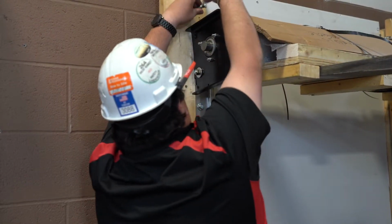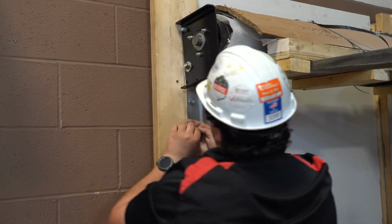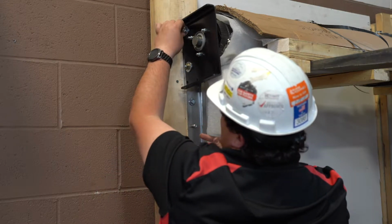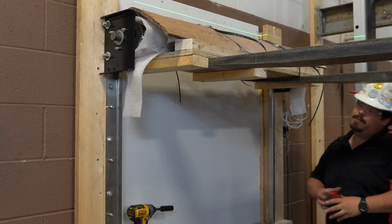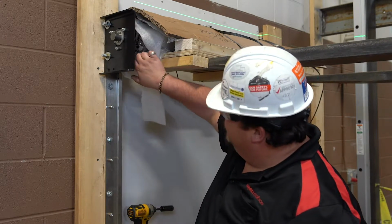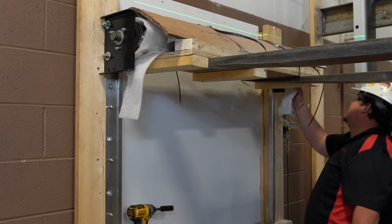Insert the top bracket hardware first while making sure the carriage bolt head faces the center of the door. Then proceed to hand tighten. Next, you will ensure that the lower bracket hardware that was installed loosely earlier slides into the open slot on the wall bracket. At this point, you will check to see that the barrel is positioned properly between the brackets. There should be an even amount of space between the operator and the non-operator side. If that is not the case, you will need to adjust.